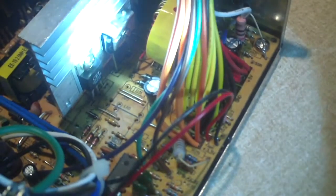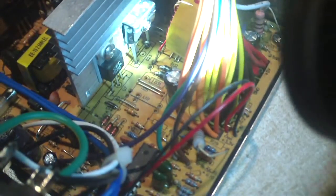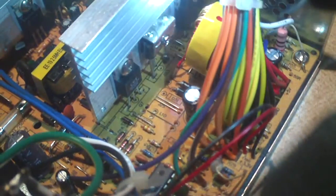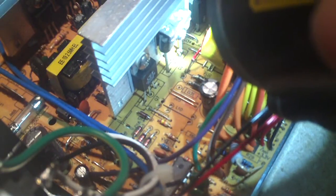It gets better. Let me get my flashlight so I can show you. Instead of using a switching diode pack, they just stuck two diodes in there and soldered the whole mess together and clamped it onto the heat sink. Isn't that just wonderful? That's probably for the plus 12-volt output. This means you could probably get maybe 6 to 8 amps out of the 12-volt rail.